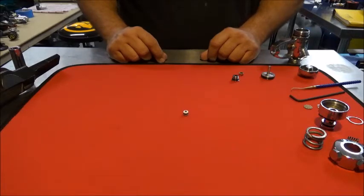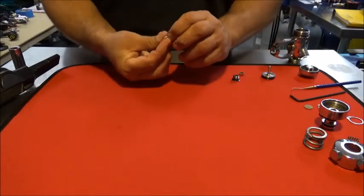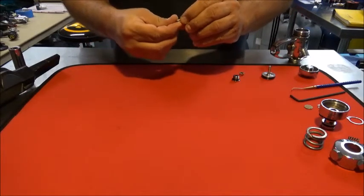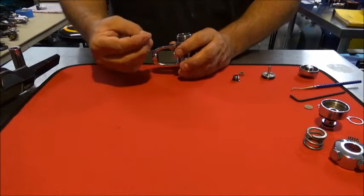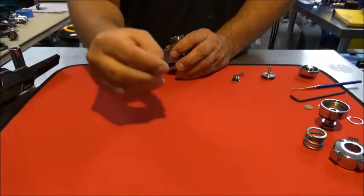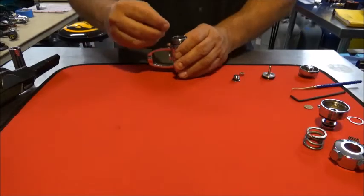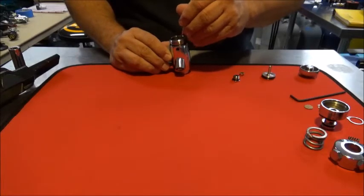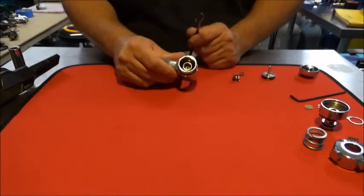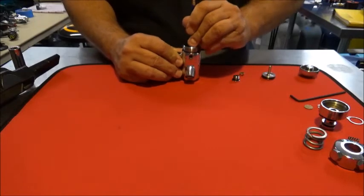I've done nothing to this one other than clean it and we're going to try it that way. After you have your high-pressure seats ready, put just a very little bit of lube around the O-ring on the perimeter - less is more, you want just enough to have it look wet. As a reminder, the flat brass part goes down in the regulator body with the small opening facing up out towards you. It may not want to drop directly in the first time, but once you get it started, take a soft tool - nylon, wood dowel, what have you - and push it into place.